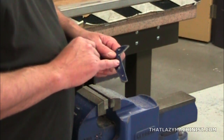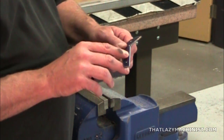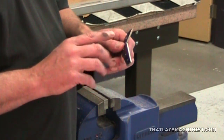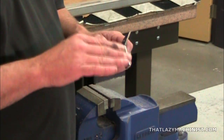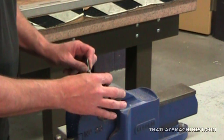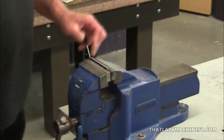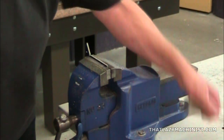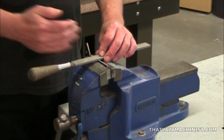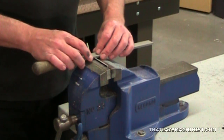Now that the roughing is complete, I can see that my scribe line is just barely visible, and that my surface is nice and straight and very flat. So we can now finish this surface by draw filing with a fine-tooth file. I can install my part in a vise, and using a fine-tooth file with a back-and-forth movement, or if you prefer by draw filing, I'm going to come and finish this surface.